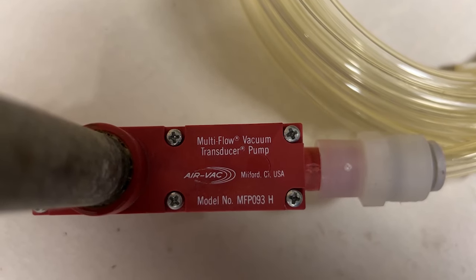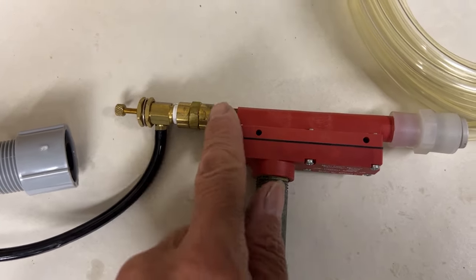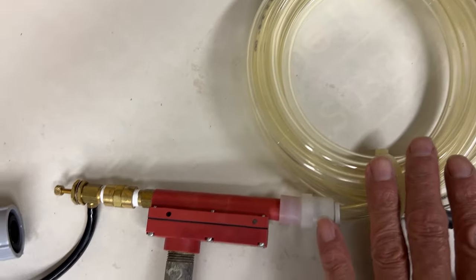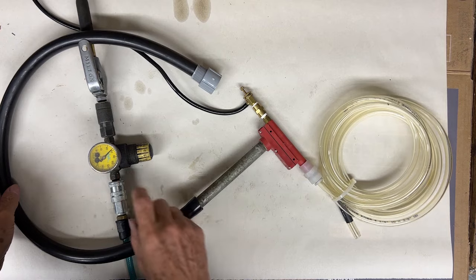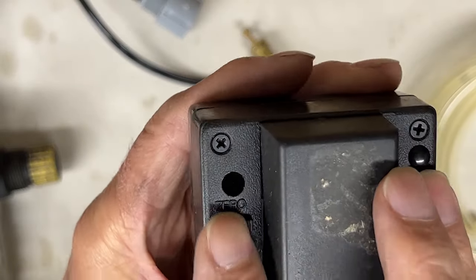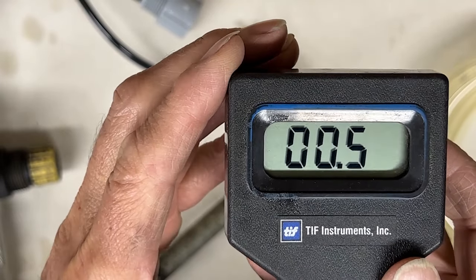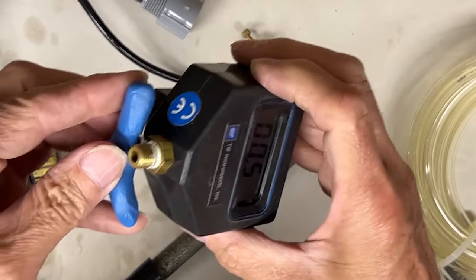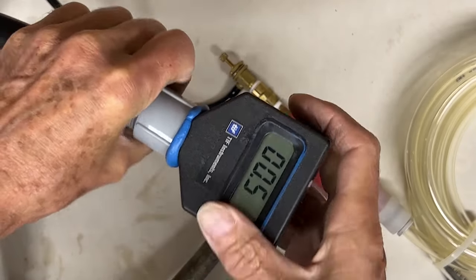All these joints are prone to becoming loose. I'll use this vacuum pump to help deliver the glue to the inside of the wood joint. Compressed air enters here, flows through the venturi assembly pump, and exits here via the exhaust tubing. This metal pipe is where the vacuum is created. A regulator controls the airflow, and a vacuum pressure gauge measures in inches of mercury — both positive and negative atmospheric pressure. I'll use putty instead of hard fittings because it's faster.